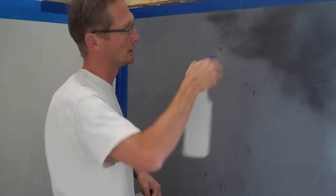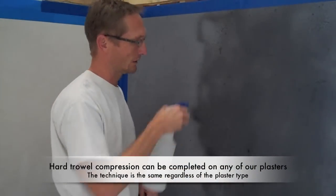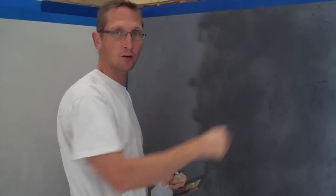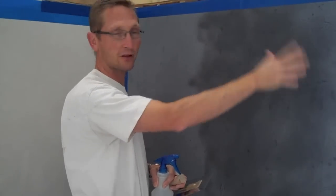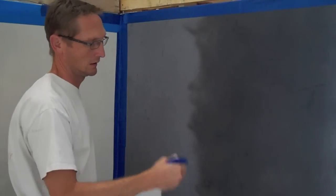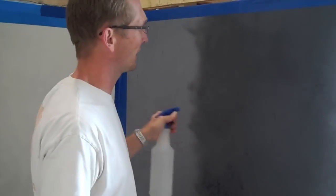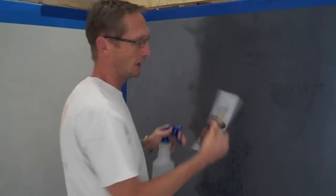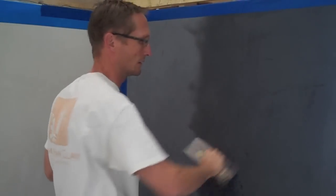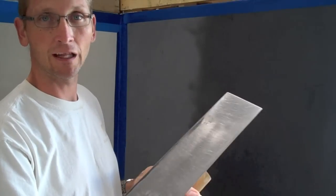The first thing I'm going to do is lightly mist or start wetting the entire surface. This allows it to slowly take in moisture and evenly distribute it throughout the clay. A lot of people just wet the wall and start troweling right away — you don't get an even moisture throughout the clay surface. Just start by letting that moisture slowly rest in. For a larger wall the pump sprayer would work much better. Get enough water on there that you can actually start moving the plaster. You can check by looking at the bottom of the trowel — if you can pick up some clay on the surface, we're getting wet enough. If you're picking up a lot of clay, it's too wet.